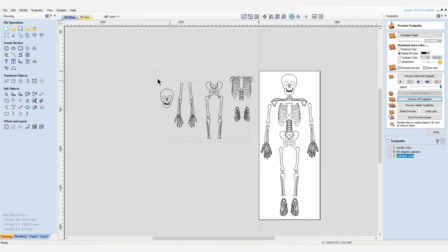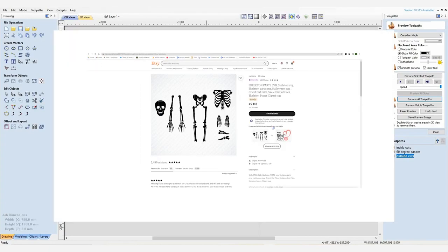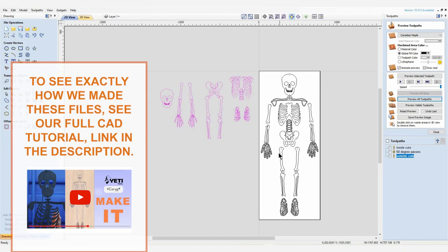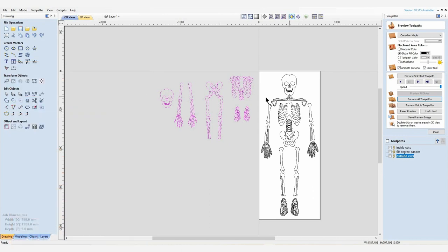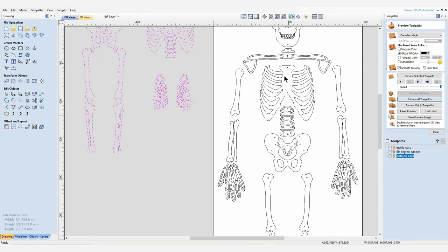Okay, so this is the file pieces that I purchased as an SVG. As we said, down in the description below will be the source of where we purchased these. And what I've done is I've taken each of these parts from this section here and I've laid them out on our sheet. As I said, our stock is 1900 by 880. So looking at the parts that we've got, you can see that I've made some slight modifications. So I've taken some of the vertebrae from the spinal column and I've created a neck section. I've also made some drill tool paths then to connect all of our pieces together with paracord.